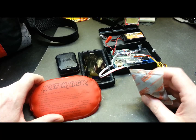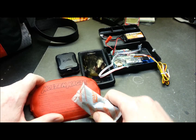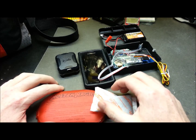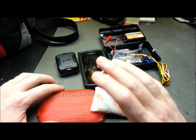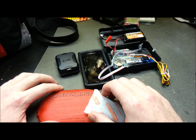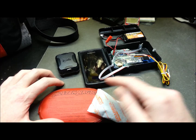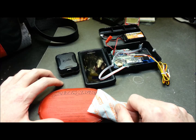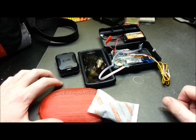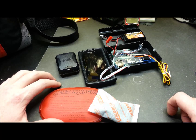So what I'm thinking is we're just about dialed in. I had no problem with overheat. I think two of these — one of each — and I'll do one more test with all the payload heating and all the electronics running. I'm going to test it at basically room temperature and see if I can get away with not overheating the cameras before we're essentially at altitude, then we're going to call it a success.